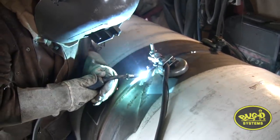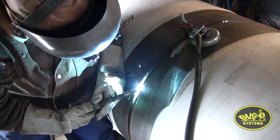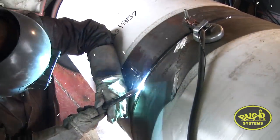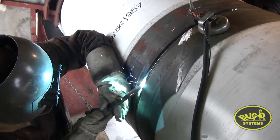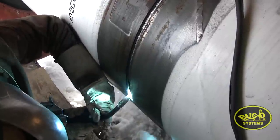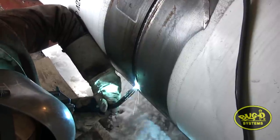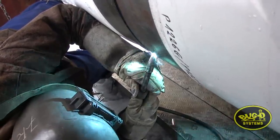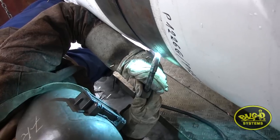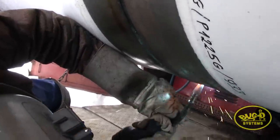The shack is lowered over the pipe. It rests on the top of the pipe but is designed so that the sides rest on the ground, giving a stable platform for welding inside. There are doors mounted to the ends to close around the bottom side of the pipe to seal off the external wind and elements. The welders enter the shack, one on each side of the pipe, and prepare to weld. The root pass is performed by hand using the semi-automatic STT welding process. The weld is established at the top of the pipe and the welder proceeds downward around the weld joint, making as few stops and starts as possible while adjusting position multiple times. The root pass is finished in the overhead position and visually inspected.